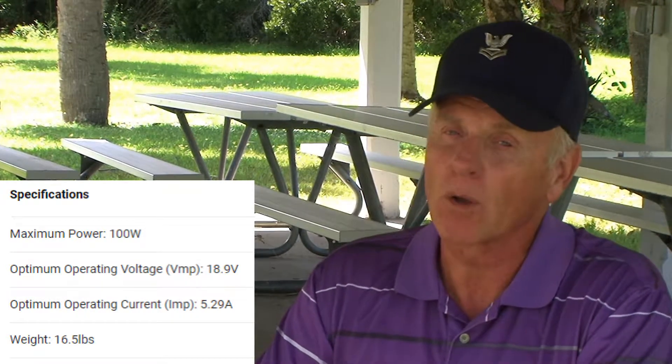That's the technical stuff — just start with the data sheet. Volts times amps equals watts. A controller marked '130': 100 is the maximum volts in, and 30 is the maximum amps out. Solar charge controllers are often sold by their amp rating — just do the arithmetic for the number of panels you have and round up. If you don't know the amps of your solar panels, take the total watts of the array — say 400 — divide by 12 for your battery voltage, and you get something like 33.1. Round up: you need a controller that's at least 35 or 40 amps. Easy.